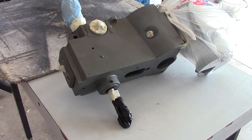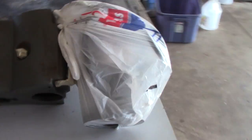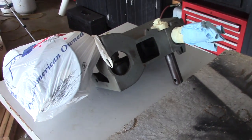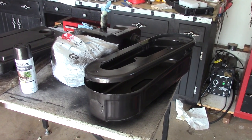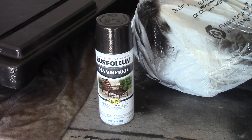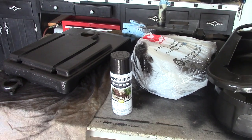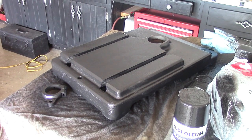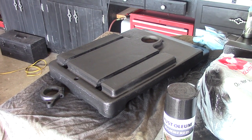Here's how I'm handling the headstock. Before I paint it, I'm taping off and covering the motor and keeping that alone, just trying to do this as fast as possible. I laid down the first coat of paint and I'm using Rust-Oleum Hammered. It has a textured finish and it's in black. The good thing about this paint is it takes an old machine and makes it look a little more modern, and that texture helps to hide any imperfections. That's just one coat so far.